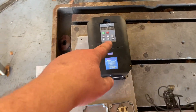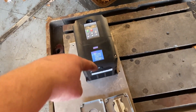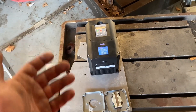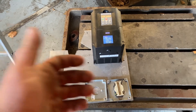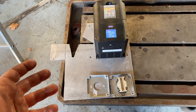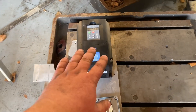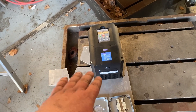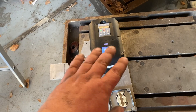So what we're going to do is feed this off of a 50 amp cord over there — there'll be a cord coming into this, going down to feed these three or four outlets. This is actually a very good option to power your shop, especially if you have a lot of smaller machines and you're running one at a time, like in a small home shop. You can just start up the VFD. Now you're going to lose some of the customization — you know, braking settings and stuff like that — but I'm just going to set this up to run 60 hertz and fiddle with the adjustments so it'll be good for the machines that run off of it.